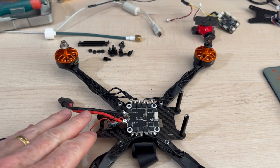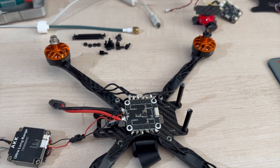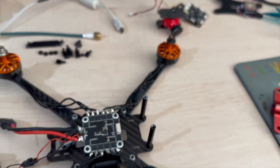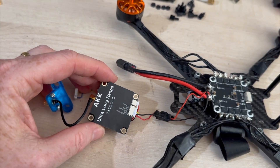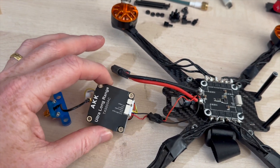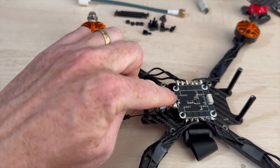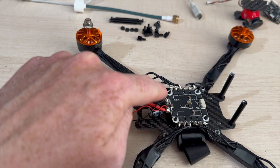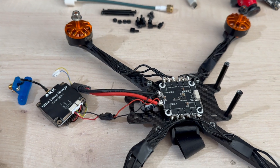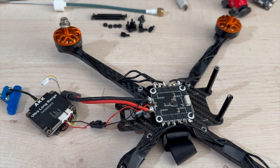Just been doing some disassembly, ready to start desoldering. Just deciding whether I will use certain parts or not. The camera's pretty good and there's a GPS there so I want to keep using it. My question mark was over the AKK 5-watt VTX — it's fine, it works nicely, but it needs at least 14.6 volts, which is why I've taken it directly off the battery. I'd much prefer something to come out of the flight controller, which is normally about 10 volts, so that one's out. Let's get this desoldered first, get the new ESC board in, and then I'll decide what to do.